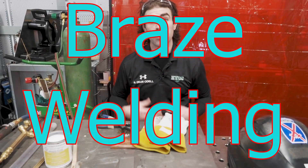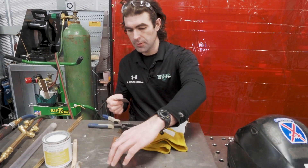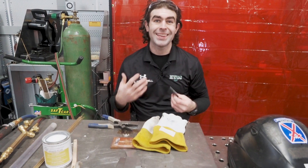Let's chat about brazing, or more specifically braze welding. I'm going to give a demonstration of braze welding two pieces of carbon steel together. The difference between brazing and welding is that in welding you melt the base metal and add the filler metal in, so you get a complete joint that's totally different from all three component parts. In braze welding you have your filler metal but you do not melt the base metal — neither of these pieces of metal actually gets melted.